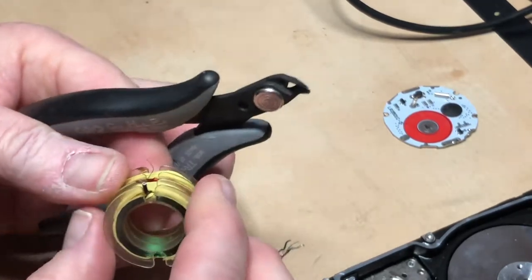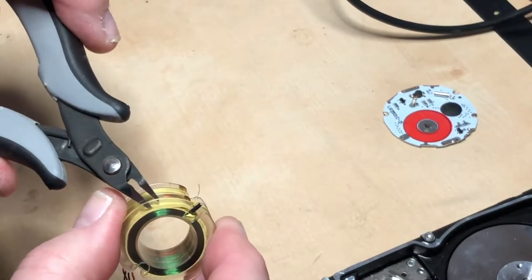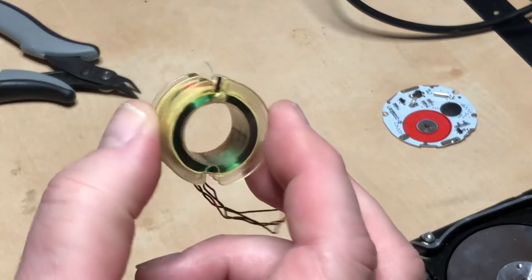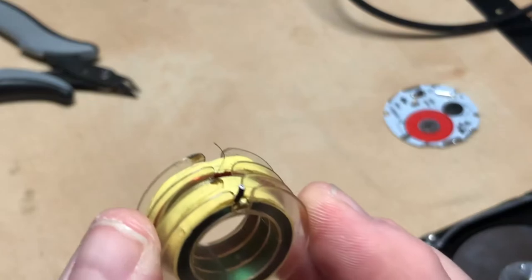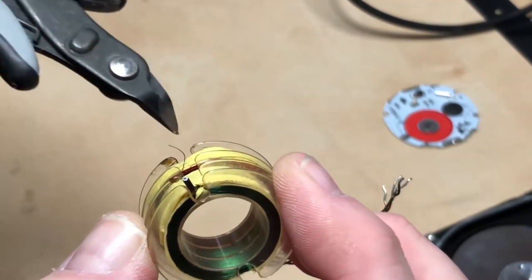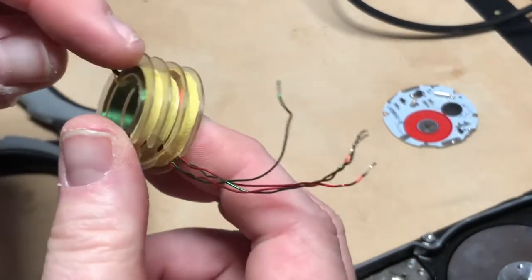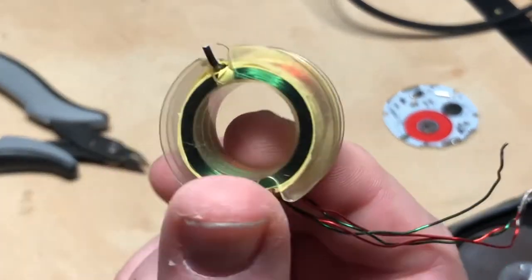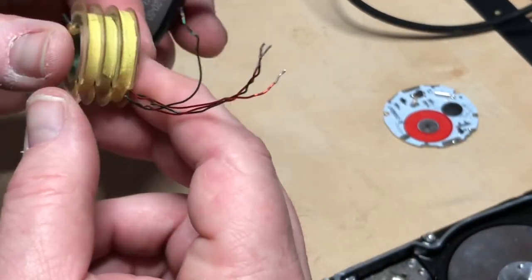You want to make sure that you don't damage the insulation, because if it touches something it'll short out. That's the whole thing with magnet wire — all it is is a coating on the wire. What you normally do is take a little knife or something and scrape the coating off, and then you can solder to it. With the coating on, it can be wrapped around itself and it doesn't make a connection — it makes a coil.